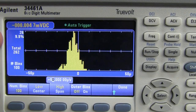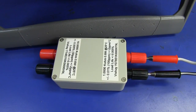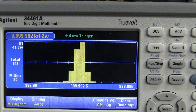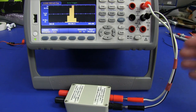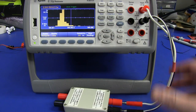This is also useful for seeing the distribution of precision references. I'm looking at my resistance standard — only 140 to 150 samples in so far. But you can already start to see the Gaussian distribution. You've got to be careful with contact resistance when measuring precision stuff — if I touch it, the display shifts because it adds items to different bins. It doesn't tell you the width of each bin — how hard is it to calculate and display that? You can also get a cumulative distribution function display, showing 0 to 100 percent.